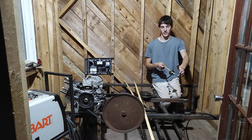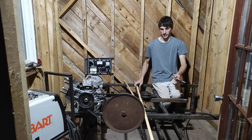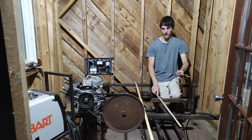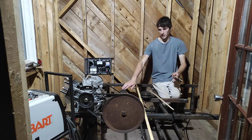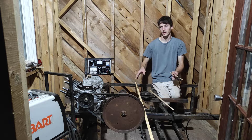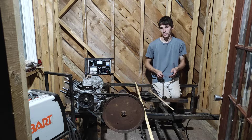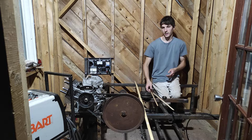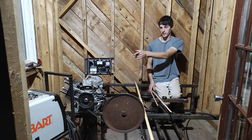You have the starting shaft spinning slow, so there's not much friction. Then you have to step it up to another shaft — seven to one, then seven to one again, then seven to one again. Or you could go seven to one, four to one, and ten to one. You can go from 18 RPM to 3600 RPM for your AC generator with just your starting shaft, two intermediate shafts, and the generator shaft.